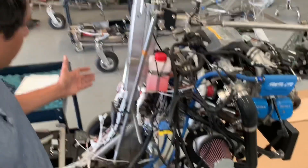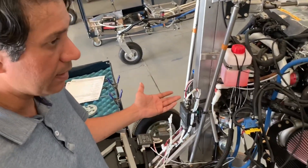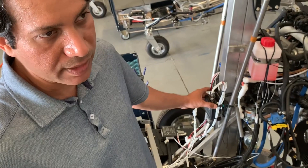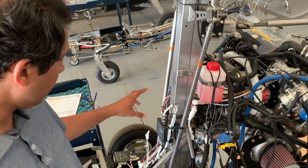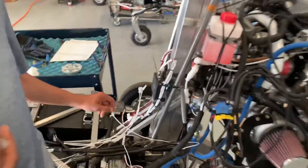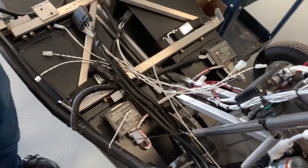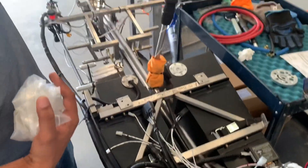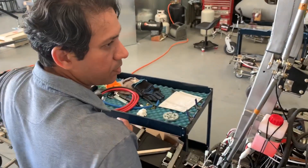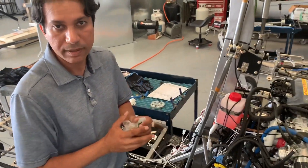It's a CAN bus system — aviation CAN bus. You have to use some system that can handle CAN bus. In this case, we have a ten-and-a-half-inch diagonal screen from MGL Avionics called the Challenger, with the RDAC IS which is made for the IS engines. Remote magnetic heading sensor, RDAC XG for the rotor RPM. All of that stuff has to be electronic, and the only thing that goes forward is three or four wires, because it converts everything into a digital stream of ones and zeros that goes to the big screen, and that screen reinterprets and shows you the data.